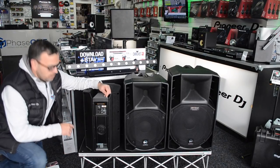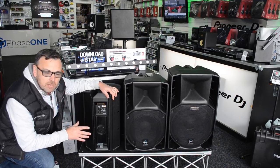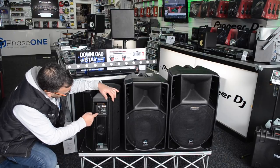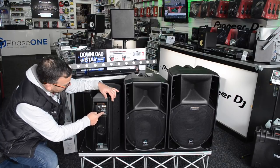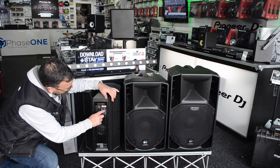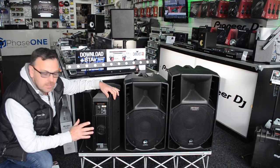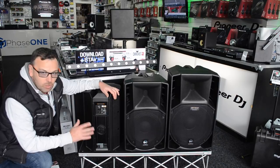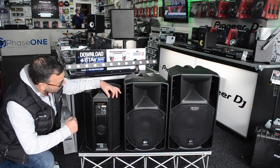Let's come to the back of the 7 Series units. Straight away, they're exactly the same as the 3 Series — they've kept it nice and simple. All we've got is XLR in, XLR out, the recessed mic/line switch I talked about earlier, a quarter-inch jack, a volume pot, and the flat/boost switch. Throughout all of the ART series the amplifier module looks the same, which makes it great when you're moving from one cab to the next or upgrading — you'll be completely familiar with the interface.